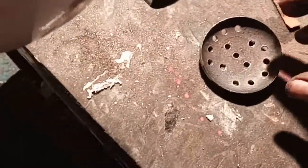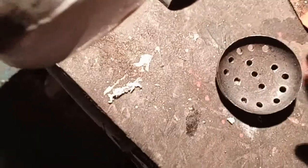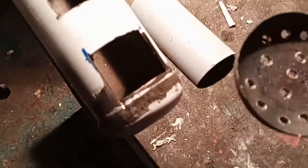I've played about with some diesel and I've come to a conclusion - we're going to burn charcoal. That can now drop in there inside, and it'll burn charcoal with the ashes collecting below. If I do want to burn oil later, I can still add an oil drip on the top and make a tray that fits inside. So I've still left myself with the option further down the line. For now let me clean this up and get it fitted inside there - the burn tray will sit about there in the fire, so I'm going to build it up a bit more to get more charcoal capacity.